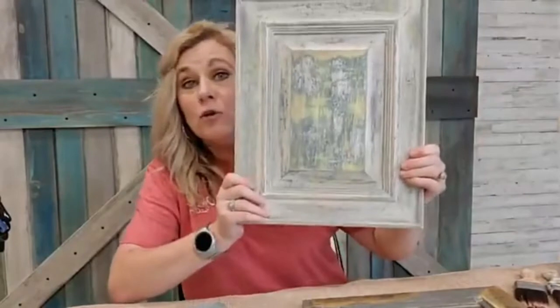In a nutshell, painting your kitchen cabinets can be done with Dixie Belle with no problem whatsoever — whether you're doing a simple finish or something fun and decorative or something really cool. Even with simpler finishes, make sure you account for cure time. That doesn't mean you can't use your cabinets; it just means they won't be at their full potential for about 30 days from the day you put your final top coat on. Humidity and other factors can play a part, but typically in a climate-controlled environment, 30 days is all it takes.